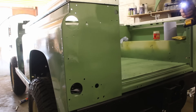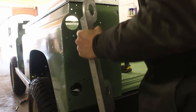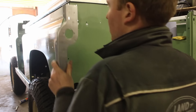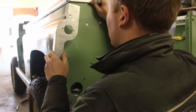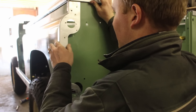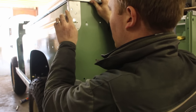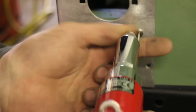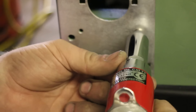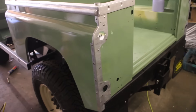We've put our cappings on — finally got those rivets we were waiting for. The 4.8mm or 3/16th inch rivets have been delivered and the galvanized cappings are ready to be fitted. Some of the holes need to be made slightly larger, and because we're doing so much riveting we're using an air riveter, which saves us a lot of time.